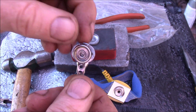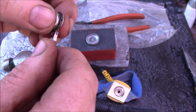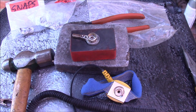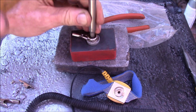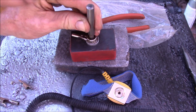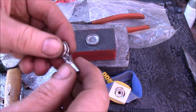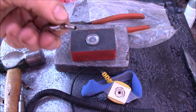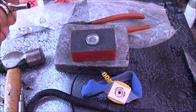You don't want to mash this down all at once — you don't want to smash these too much because you can drive the little head of the snap through there if you go too hard. It's always easier to tap it a little more if you need to. That should be pretty good, and I'm going to give it a little bit of a bend, then go inside and see if that works on my bench.